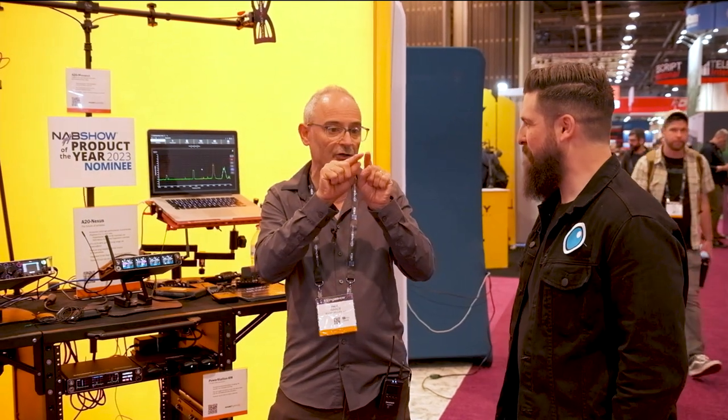You're always going to be able to find a clean frequency, no matter where you are in the world. Most competitors can't cover that wide range, and even if they want to move to different blocks of frequencies, you have to buy different hardware — making inventory costs and management very difficult. Spectraband also divides that wide range into smaller tuning bands defined by very tight, almost brick-wall filters, which filter out out-of-band interference like DTV, IFB, and walkie-talkies — a very common problem now.